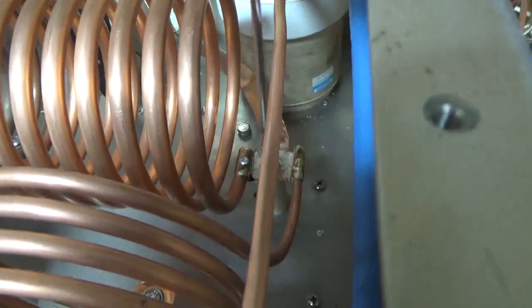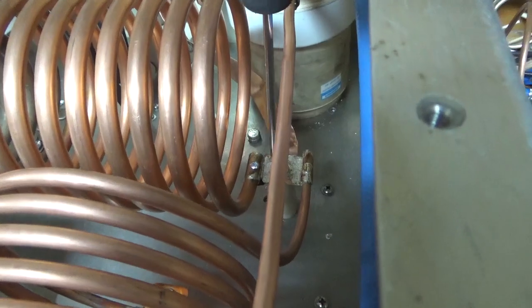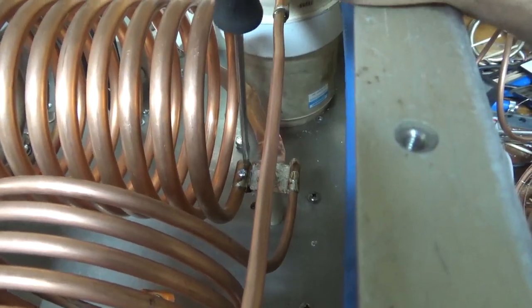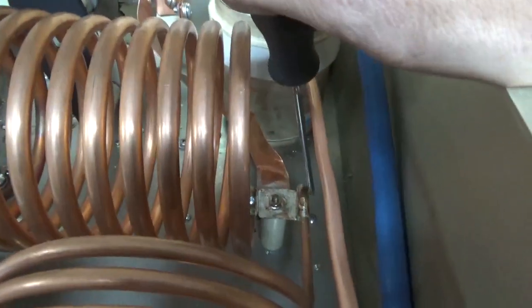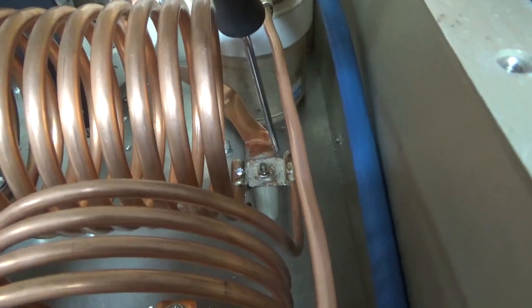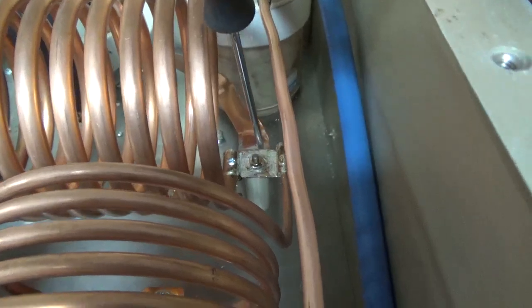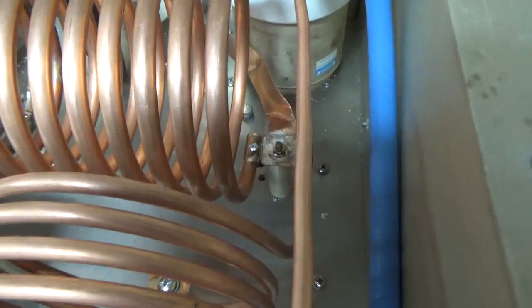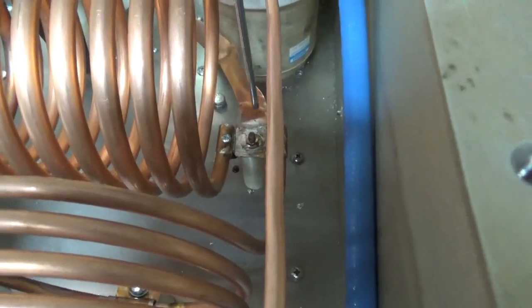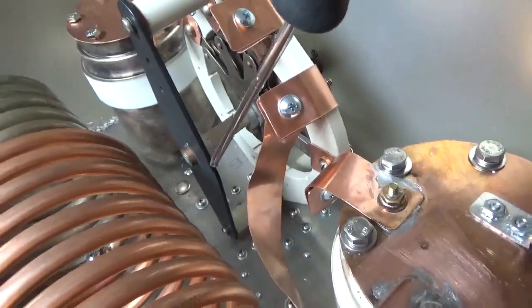The coil goes back over to here. I have the piece of copper that's wrapped around, screw goes through it, soldered, and the 1-inch wide connects to the standoff. I did the other side the same way — wrapped around, crimped, soldered, screw through it, and then I have the strap. This is the 160, where the 80 junctions meet, and the strap goes back to the band switch. Plenty of clearance on the strap and everything around it.